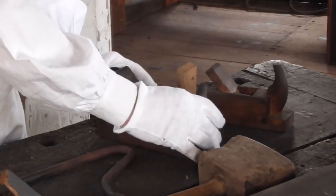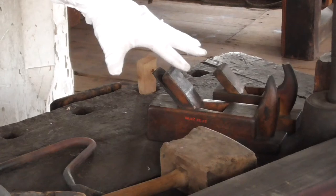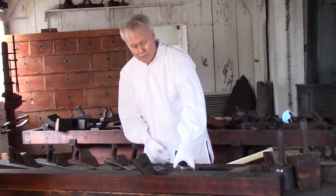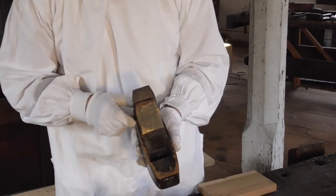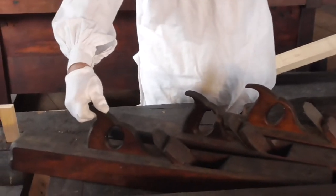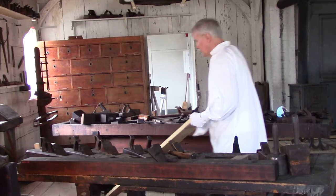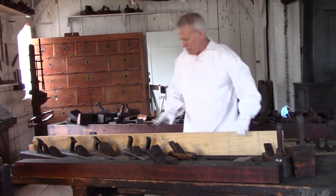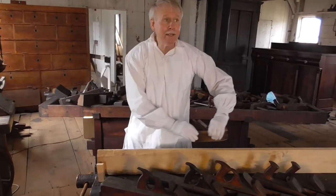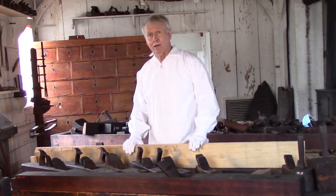Then you've got your other basic flat planes. This is sometimes called a coffin plane because you can see the shape of it. But this would be like a block plane. And you think, 'Oh gee, this is a lot more convenient to use than this.' So why the difference? If you use the smaller one, what will happen with a board — say if I was to turn this into a tabletop and this was a board in a tabletop — if I use the small plane to do this edge, you wouldn't be able to get it straight enough. So the longer the plane is, the more accurate you can be. The disadvantage to longer is they're more heavy and more difficult to use.